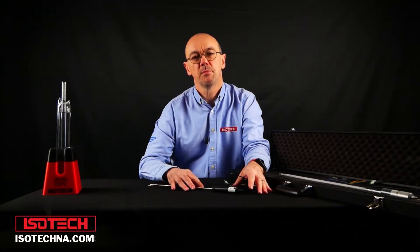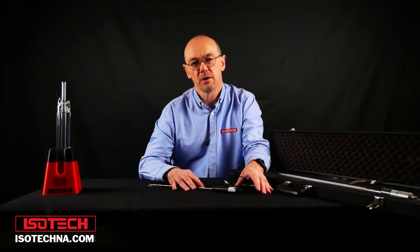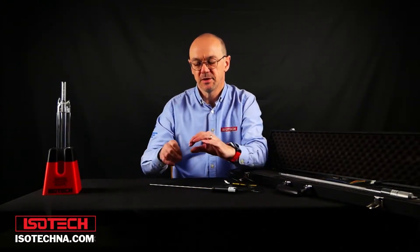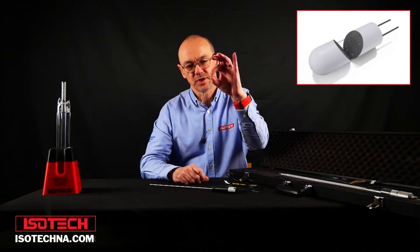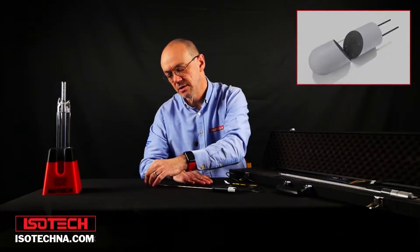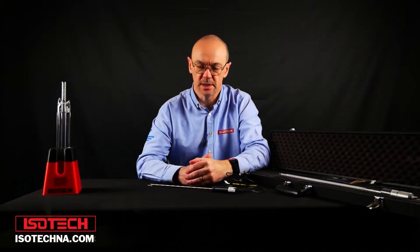Let's start with the IPRT, the Industrial Platinum Resistance Thermometer. People call them PRTs, Resistance Thermometers, RTDs, PT100s. Strictly speaking, this is an RTD — a Resistance Temperature Detector — and that's located usually at the tip of the thermometer. PT100 is the most common type of RTD.